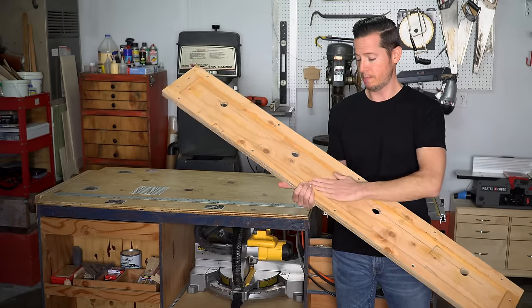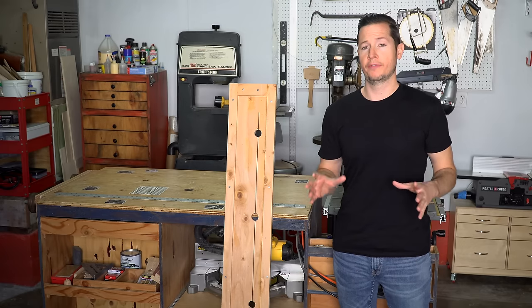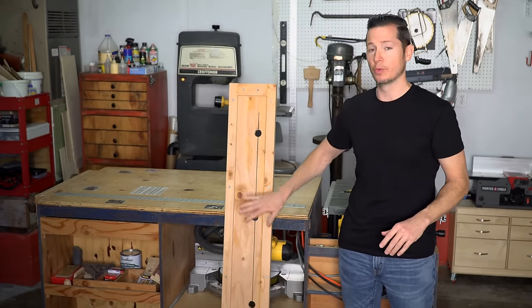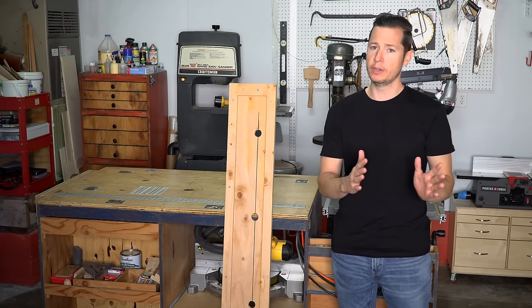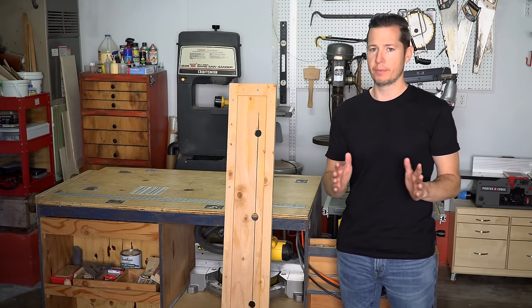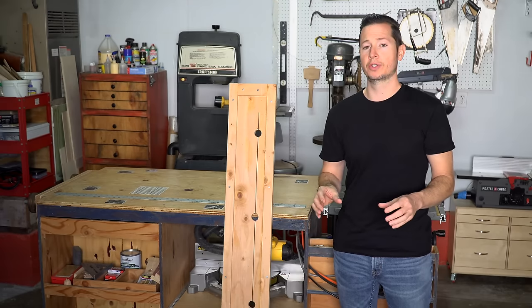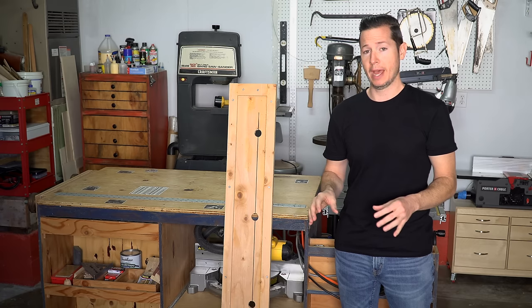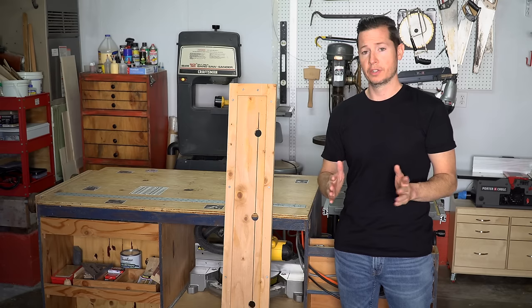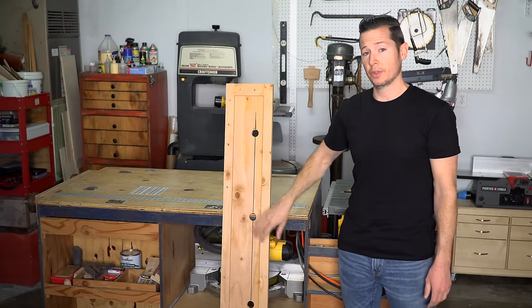This track captures your saw on both sides and allows you to align the track with your mark via these sight holes. I had wanted to make a track saw for some time but hadn't seen a design that would prevent your saw from moving in both directions and still be really simple. Simple designs only prevented movement in one direction, while more complex builds stopped movement both ways but required pieces attached to your circular saw and dramatically reduced the depth of cut. So I finally came up with this design that stops your saw from moving either direction for perfect cuts, is a very simple build, and allows for a much greater depth of cut.